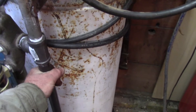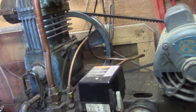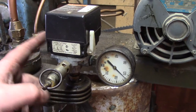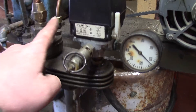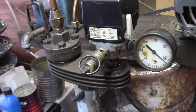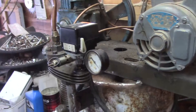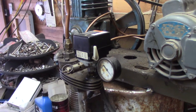Surprisingly got a little bit of heat this far down into the unit. Obviously the copper — that's the purpose of that big copper coil, to just vent off some of that heat. The way the bleed-off valve works: it has what's called an unloader, so when the unit is off it vents air out. There's a one-way check valve — what ends up happening is it bleeds the pressure off on this side of the check valve, then the check valve closes. So when your air compressor starts, it's starting not against tank pressure but against no pressure in the lines. When you see cheap compressors that just hum and struggle to start, it's because they don't have an unloader. You can buy that part and retrofit it.